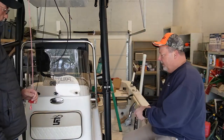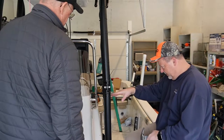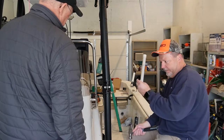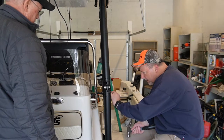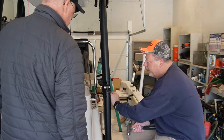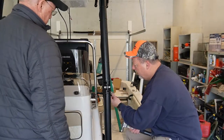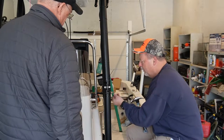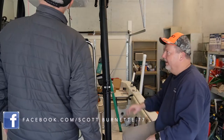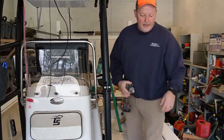So we've got to get the angle right. I can't go flat but I can go just a little bit. We'll take a center punch — need to come up above center. Yeah, I'm right above center right there. I don't know why I'm doing this, this is your boat — I'd rather blame you forever instead of me going 'hey look what I screwed up.' All right, get me a quarter inch drill bit, we'll go right here — all right, here we go.